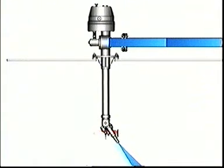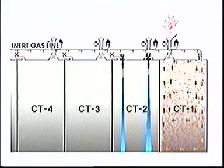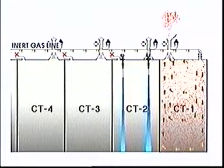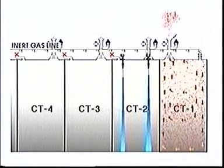In some ships, it's possible to take samples of the returning water at the pumps. Before you finish with the tank, it might be a good idea to wash it with clean water from the sea for a short time. If the return water is clean, you can be pretty sure the tank is clean. When you're satisfied that the tank is clean, prepare to purge and gas-free cargo tank number one as soon as possible while you're cleaning the other tanks.